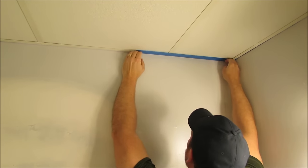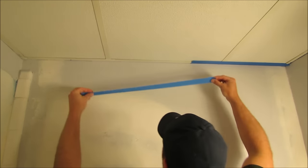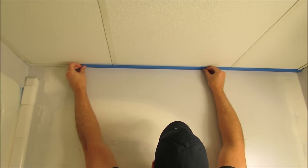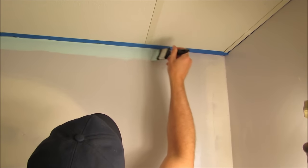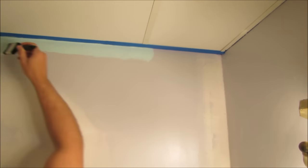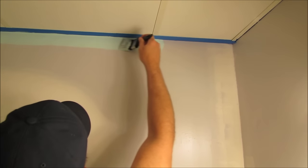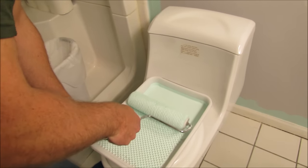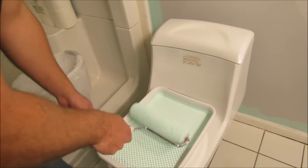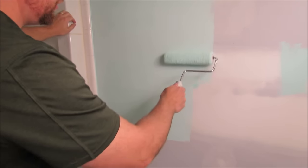Here I'm taping off the ceiling. I have to admit I can't stand taping and cutting in, so a lot of times I'll have Jennifer do it — to be honest she normally does a better job because I get bored. Another reason I have Jennifer do this is that I don't put a thick enough strip of paint on, and when you start rolling, the roller won't go all the way to the edge. You need good coverage there. I'm loading up my roller with paint — enough so it's not dripping — and then I start covering the walls.